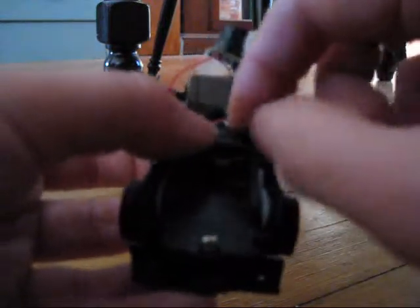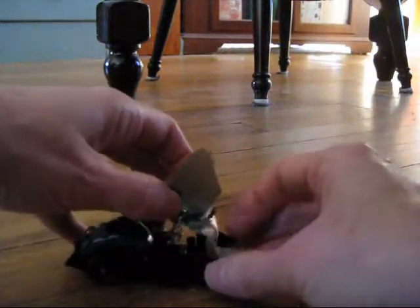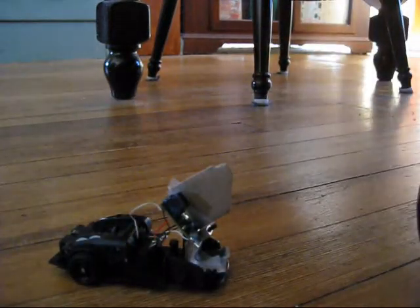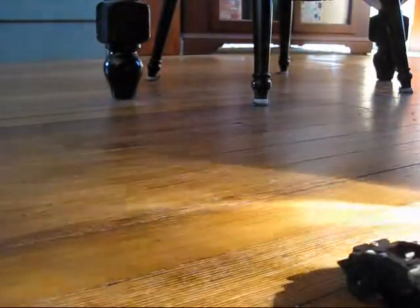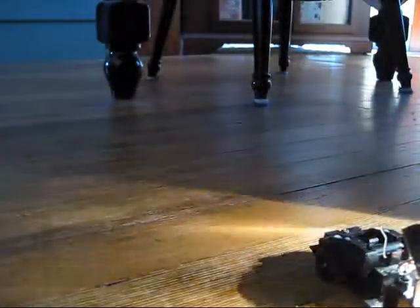Making sure not to pinch the wires. Now let's see what happens — get the sensor set up here. When I shine a light on, let's say, the left sensor here, now our vehicle is going towards the light instead of away from it. That's all that's involved in making a light-avoiding or light-seeking robot: which motor is powered. I think that's pretty cool.